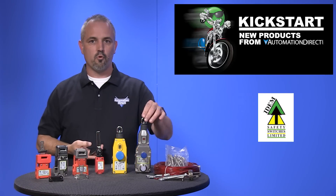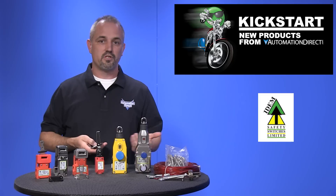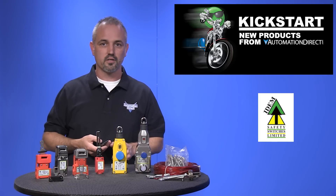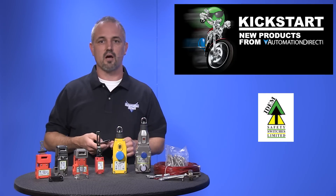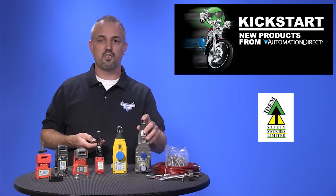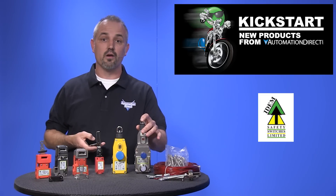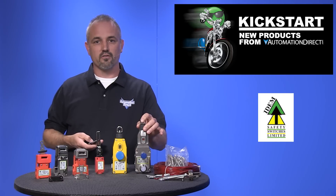Next up is the cable pull grab wire safety rope switches, which are designed to be mounted on machines and sections of conveyors that cannot be protected by guards. In contrast to traditional mushroom head type emergency stop buttons, cable pull safety rope switches can initiate the emergency command from any point along the installed rope length and provide robust emergency stop rope pull protection for exposed conveyors or machines.